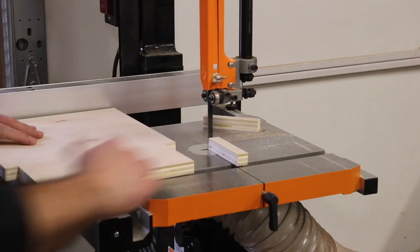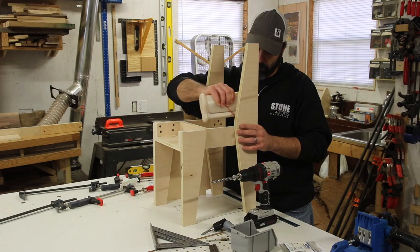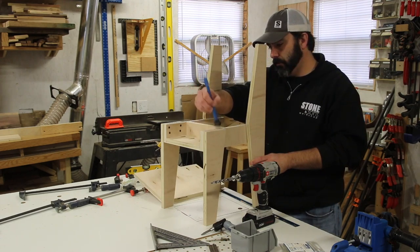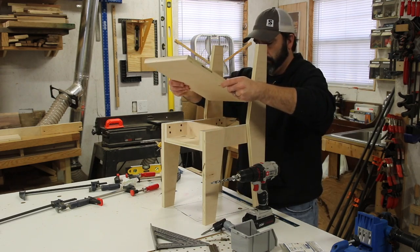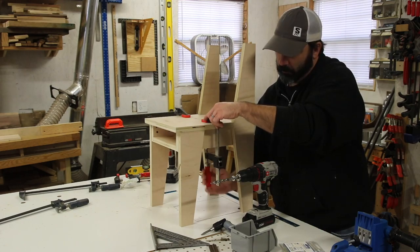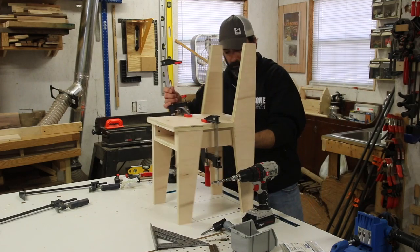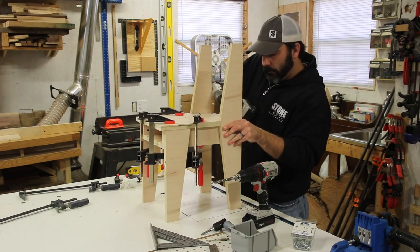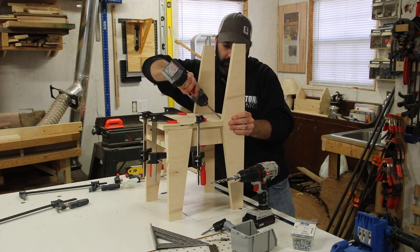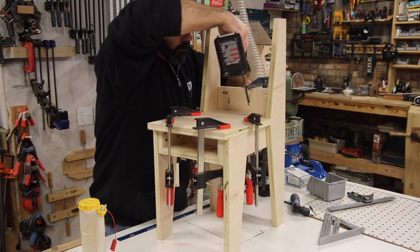The next thing to do is cut out the sections on the seat that will fit between the two back legs and the chair upright. I put a couple of pocket screws toward the back — they'll be hidden in the next step — and I glue the rest of it down and clamp it until the glue dries. That should be enough, but if the chair isn't holding up, I can just pop some brad nails in it.